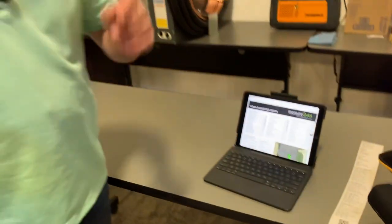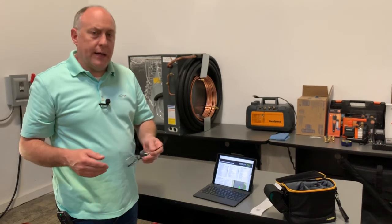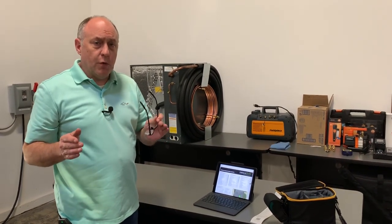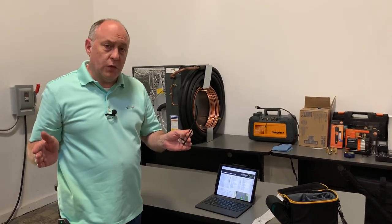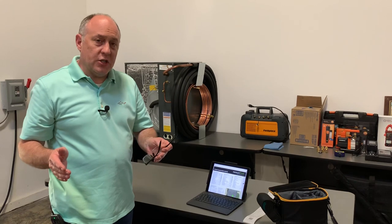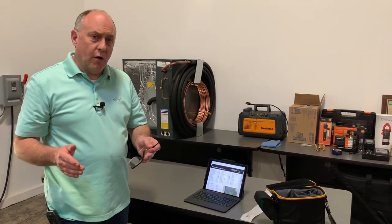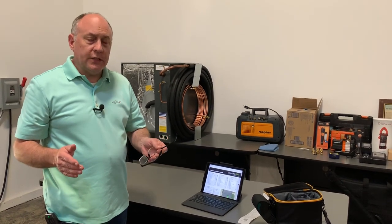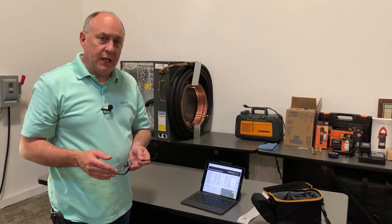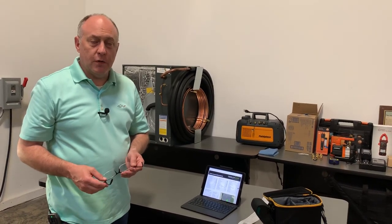This gives you a really good idea of how to go through and do a job report in MeasureQuick. If there's a problem, MeasureQuick will flag it right away — it can tell you if you have a restriction in your liquid line, return duct leakage, or one of probably 150 different problems it can diagnose. It makes you much more efficient at diagnostics and troubleshooting. It's about letting the tools do the work for you — getting the job done faster, done accurately, and making sure younger technicians aren't missing billable repairs. Thanks a lot for watching — if you have questions or comments please leave them below, subscribe to our YouTube channel, and like our Facebook page.